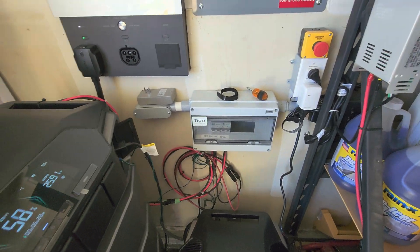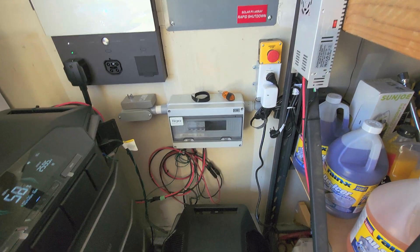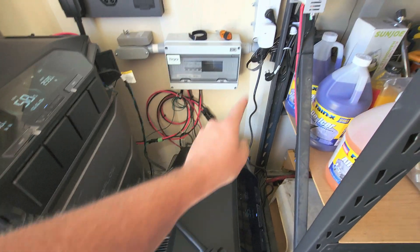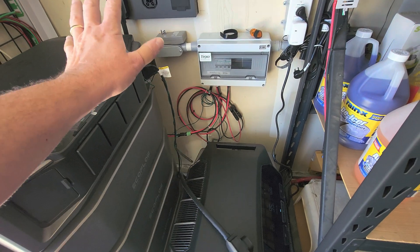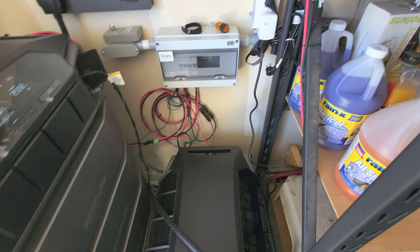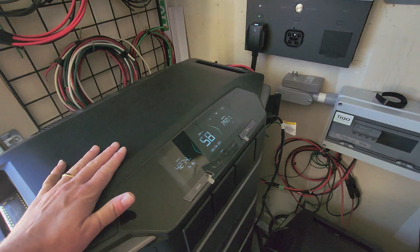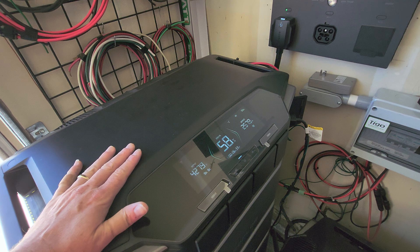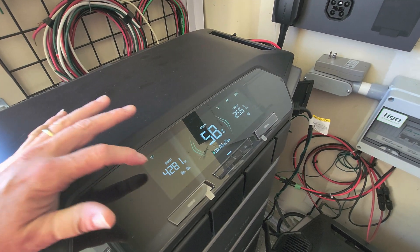You have to disconnect it because the smart home panel won't allow the DPU to take the AC charge as long as it sees it on the main line. So you disconnect the main line so it doesn't see it, and then the DPU will take the AC charge. It takes about four hours on a good sunny day. The battery has been getting up to the high 80s, almost 90s — I set mine to 97 — so it's been working well as long as I have a decent input.